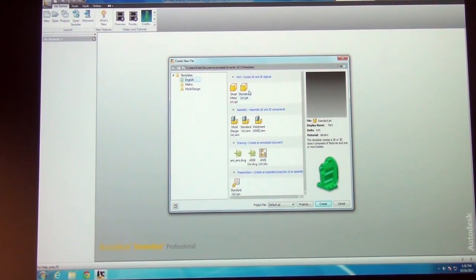The standard part files are both up at the top, and you have a choice between two: a sheet metal part or a standard part. The sheet metal part can be bent up, and you can't change the thickness once you set a material — it's that thickness throughout. As for exporting STL: yes, Inventor can do that. And that's one of the nice things about building parts here — you don't have to check if they're closed or if there are gaps. They're all solid models pretty much from the start, so you just export as STL and start printing.